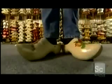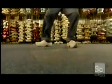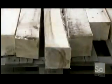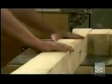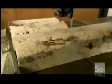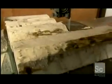How they're made remains as basic as the shoe itself. Most wooden shoes are crafted from poplar, a wood that's easy to carve and generally free of knots, so the wearer won't encounter any splinters. A worker feeds pieces of poplar into a bandsaw, careful to toss any pieces with defects. The blade slices the wood into blocks called blanks.